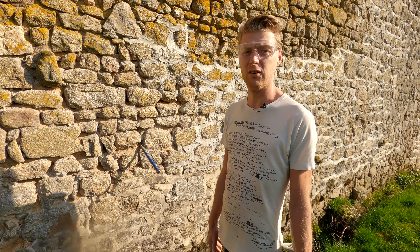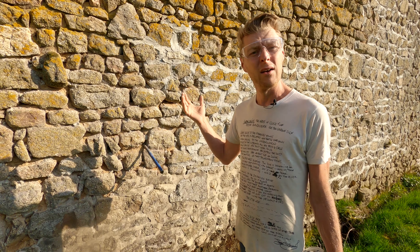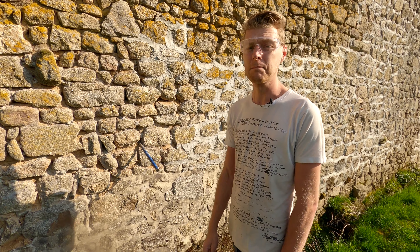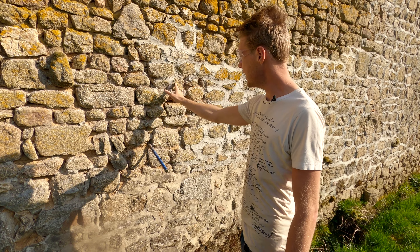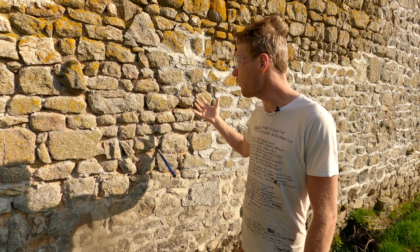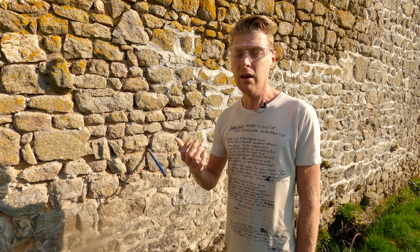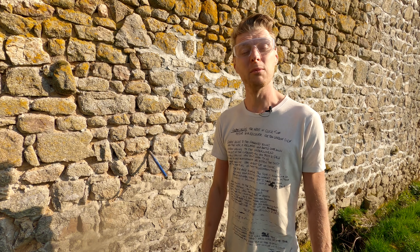At that point you can call it a proven technology. But what happens with cement — and the reason why these are so bad — is this person obviously thought the wall needs pointing, and I'm going to point it. But then what happens is the water gets in behind the cement, unwashes down through the stones when it rains, and it washes out all of your lime mortar. Because lime can absorb water, but cement can't. And so that can prove really problematic for a building. Because if it freezes, not only does it give you damp, but it can actually crack your house, which is sub-optimal at best.